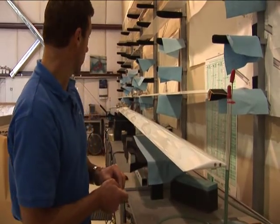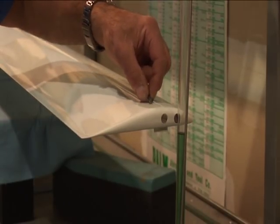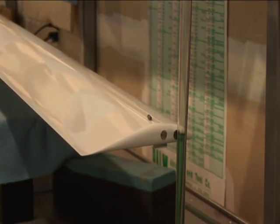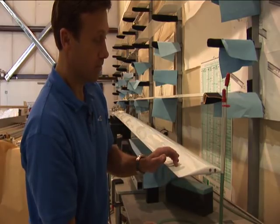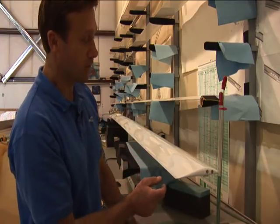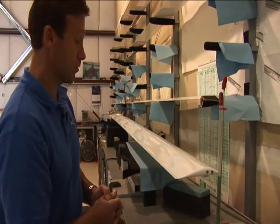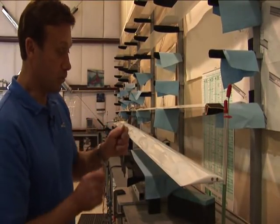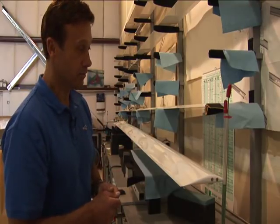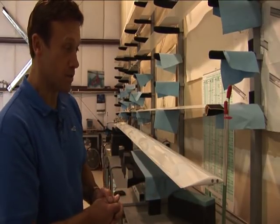If your blades are out of balance, remove the forward screw, back it out, and put a piece of lead in there. You can lay it right on there and see whether the blades are in or out of balance — this little piece of lead throws it way out of balance. When it's knocked off, the blades are in balance, though you have to wait a little bit since even someone walking by can cause the blades to move — so you want no wind in your shop. This checks your balance statically on two hardened parallels, with the bolt teetering freely, at the same height at both ends.